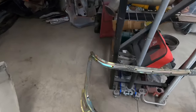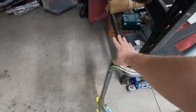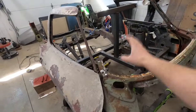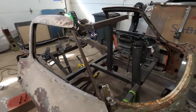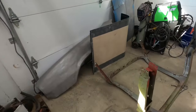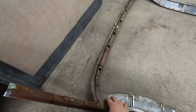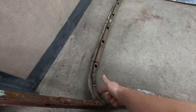Now, this is for a convertible because it has these little tabs up here, and obviously there's nothing flowing into the roof. But what we can do is remove this old windshield frame, fix this damage, put that windshield frame in place, make sure it lines up with the doors properly. And once we're happy with that, we can introduce the roof and splice it in, because the biggest difference between the coupe and convertible would be this area right here, which is in pretty good shape.